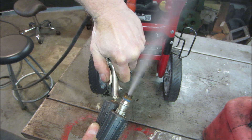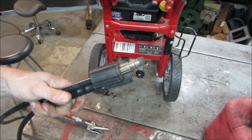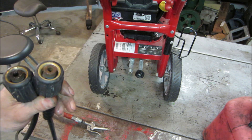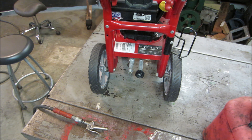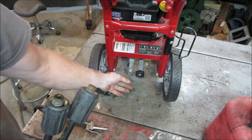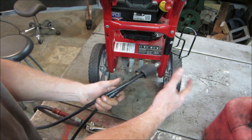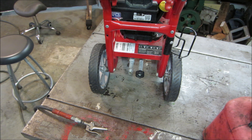Let's see if any crap comes out — yeah, it's full of water. What happens in the wintertime around here: people just put it away, put it in the garage, and the pump has water in it and the hose has water in it, and it causes them to freeze. The gun, same thing. The components start cracking. Sometimes the hose is okay because it's got some flexibility, but the pump and the gun — not so much. What I do: I have a little fitting that fits an air hose chuck with a tire valve on it. I just put my tire chuck from my compressor on it like you're filling a tire, pull the trigger on the gun, and it blows the whole system out — gets all the water out. That's how I put them away for the wintertime. Works pretty good; I haven't had an issue doing it that way.